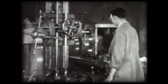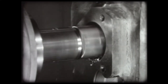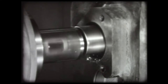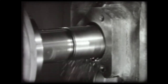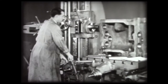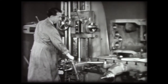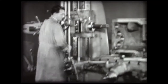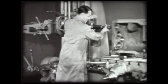When boring short distances, feed the spindle rather than the saddle. This is more convenient and spindle deflection will not affect the accuracy of this cut. When the roughing cut is finished, clear the tool and run the work back so that the boring bar can be removed. Since this is a production job, the tool can be left in the bar so that it will not need resetting for the next piece.